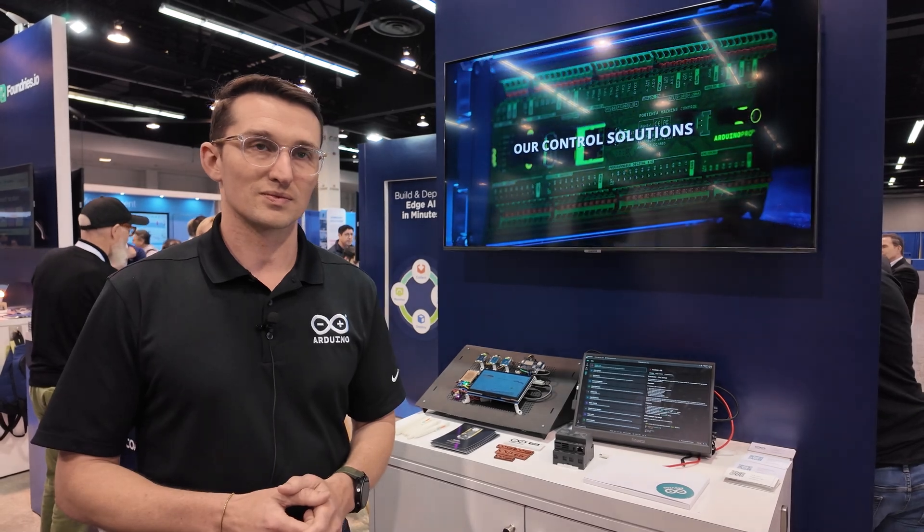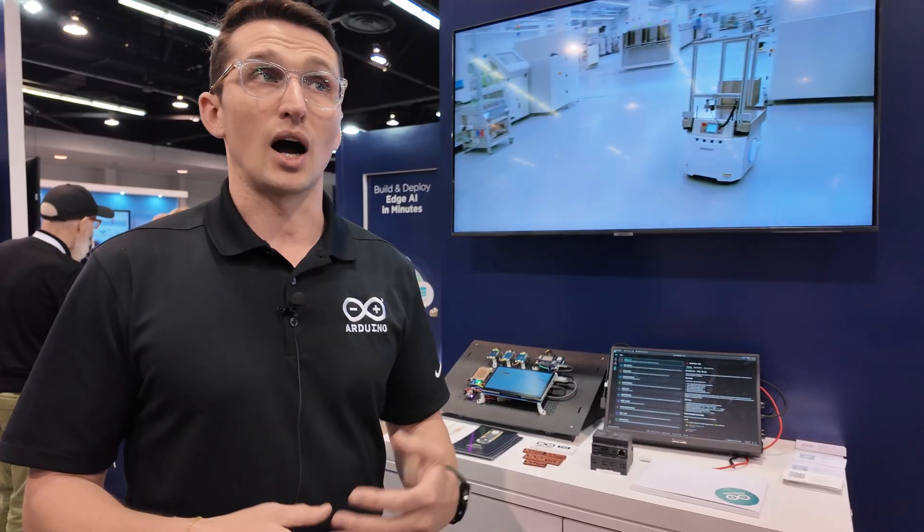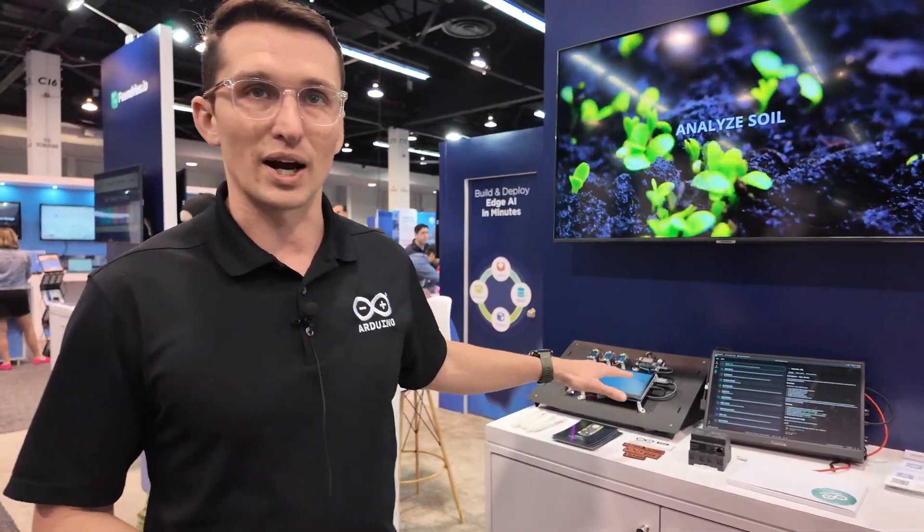Sometimes the big Cortex-A core could have the functionality of the MCU also, so maybe you can do the same stuff without the MCU. It really depends on what type of application you're running on that MPU. For example, if you are just running some GPIO, you could easily do that on the MCU by itself, or if you wanted to manage that as a custom container and you're more comfortable in Linux, you could run that on the MPU.